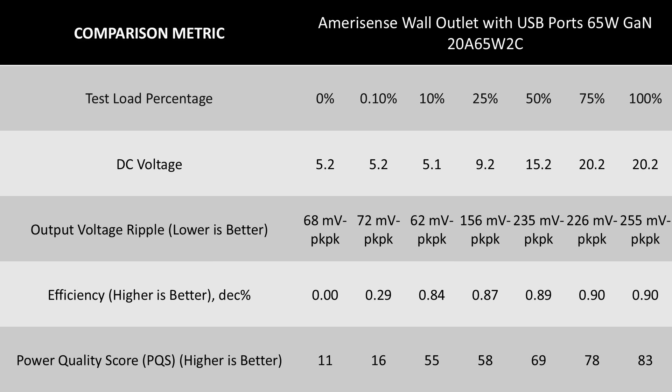It is still not as good as the best 65-watt external adapters, but it is at least as good as ones that overheat. In terms of the performance of this charger, the DC output voltages look fine, the ripple was within a reasonable range for the voltage levels being supplied, and the efficiency looked much more normal for a USB power adapter, but it could be higher.